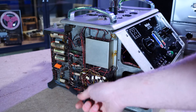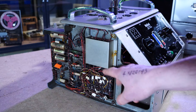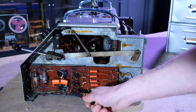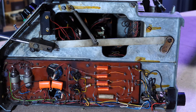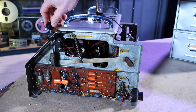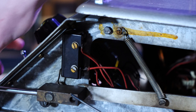On this side there's a transformer and a few capacitors that are looking nice and crusty. I've got these capacitors on the way and I will be replacing them before I use this for quite a while. There's not that many capacitors in here and these are the only problem ones right now. On the other side, you'll see there's two holes where a couple of smaller, more modern capacitors are — these two canister capacitors have already been replaced with some blue electrolytic ones. Also on this side, you get a peek of the lever that engages the punch card assembly, and as you engage it, it also opens this switch that turns it on.